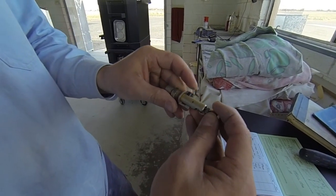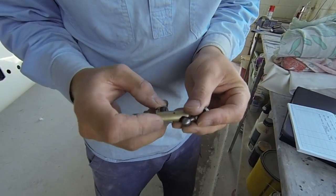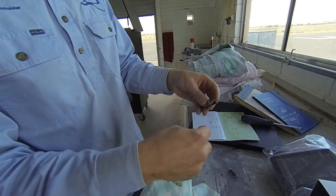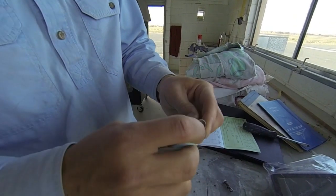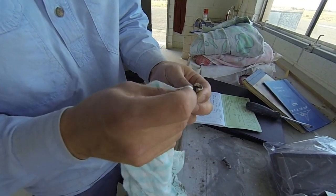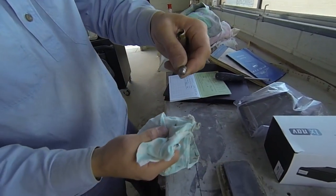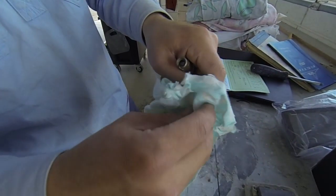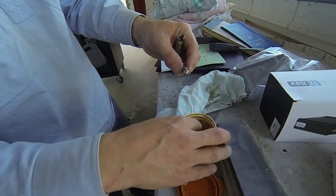We've got the coupling and the ball. When we want to connect it, we depress the wedge. Let's go through the cleaning first - before we rig it you clean the coupling and the ball. Just get a bit of rag, scrunch it up in there, and by simply turning the rag in there you can give it a clean. That's looking a lot better - bearing in mind this has probably got a bit of old grease in it because it's been sitting in the cupboard for 10 years. Same with the ball that'll be on the end of the rod in the wing.